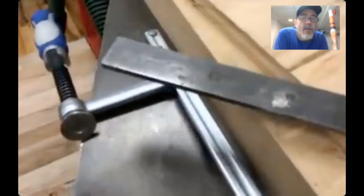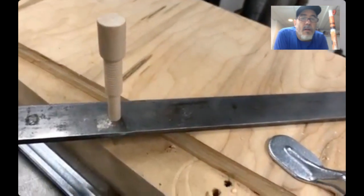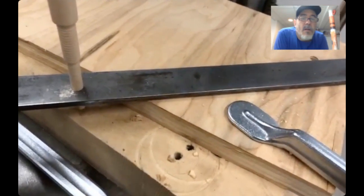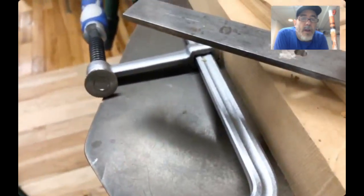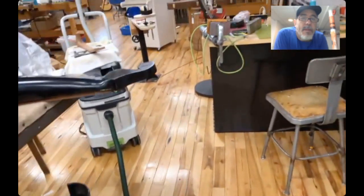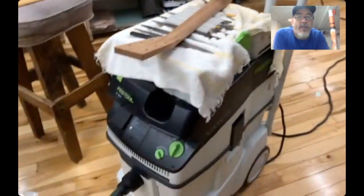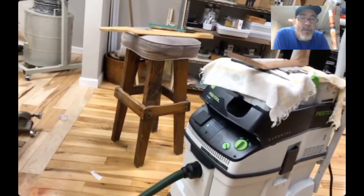I've got them in walnut and maple — I tried to get StewMac to buy these but they never did. They're killer though. If I want a dowel I just drive it through. I've never bought a dowel plate like Tim was talking about, but I drill holes in steel — this one was matched to the drill bit just undersized so I can ream it. I have reamers that are minus one and plus one which makes for a good fit. I'm gonna buy one of those hole plates — I've made so many over the years, just too cheap to buy one, but now I'm buying one.